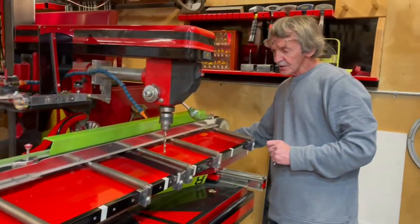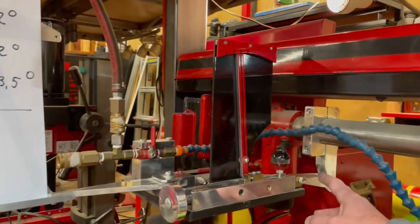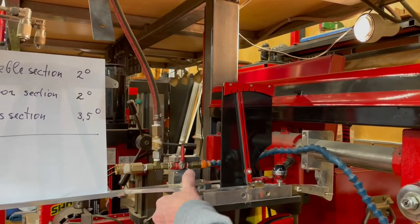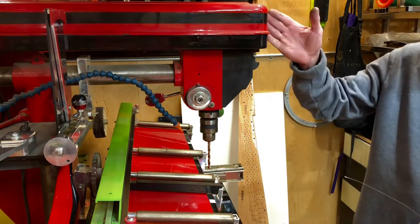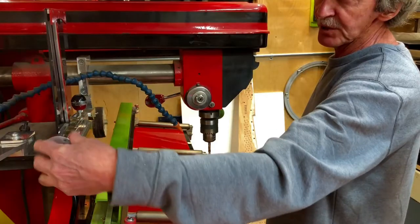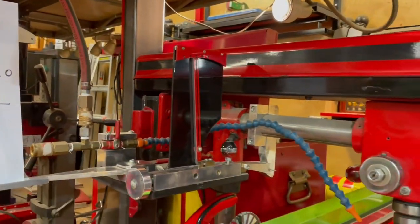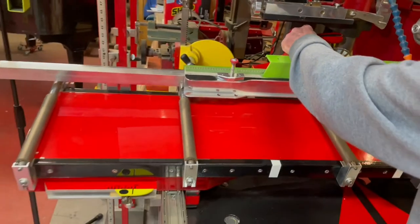Once at seven and a half degrees, we lock it from both sides to be sure it's stable. This device is attached to our radial press, and by rotating this knob we can change the position of the drill press. You see it's square — this is zero degrees, going square to the pin block. Of course I want two degrees, so I make this adjustment, put it to two degrees, and lock it because there will be some vibrations.